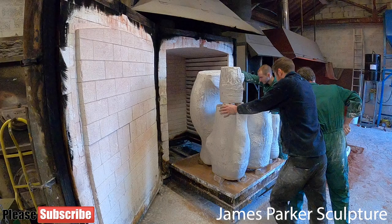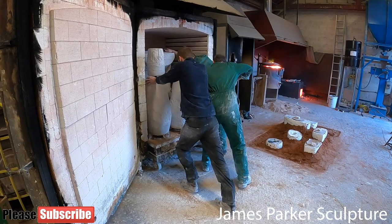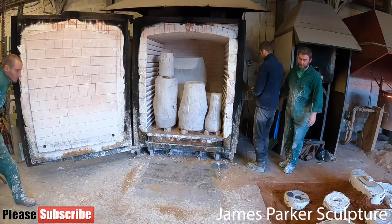Metal pins are hammered through the wax model and into the investment core. Next, the wax shell is completely covered in heat-resistant material — these structures are known as investment moulds. The investment moulds are inverted and placed in a kiln at 600 degrees Celsius. During heating, the investment material hardens and the wax runs out through the ducts created by the wax tubes.